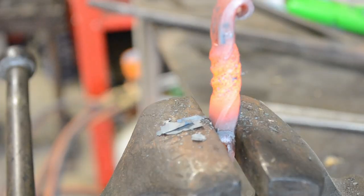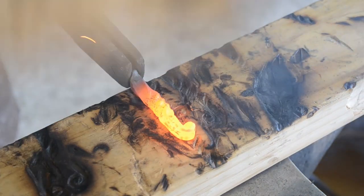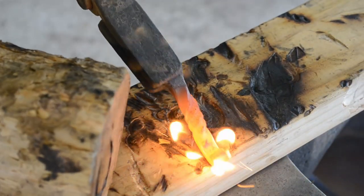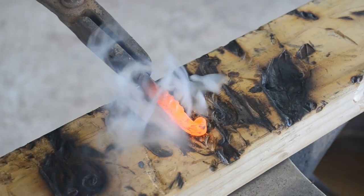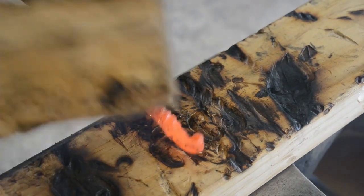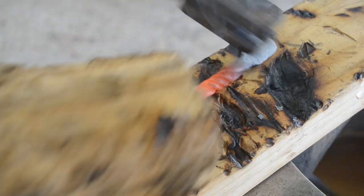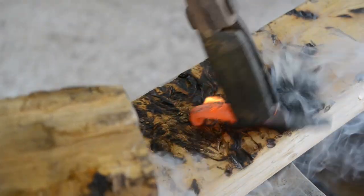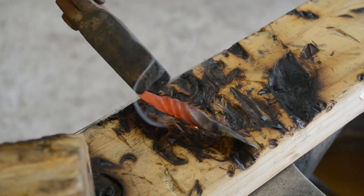I did it with a little shifter there. And you want to make sure that you're gripping it quite tightly with the shifter. Otherwise, it'll just slip off and cause marking. And because you never get it straight, using a block of wood and a wooden mallet, you can just straighten it out without risking denting your twist, which is never good for the finished product.